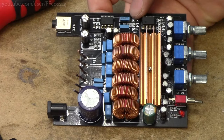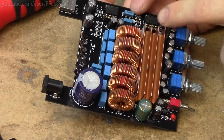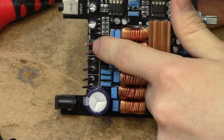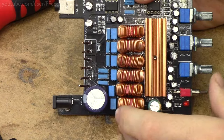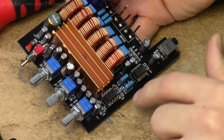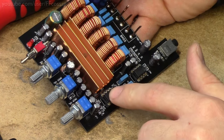So before we wrap this up, here's just a quick look at the actual board. Notable features, we've got two NE5532s there, obvious Chinese copies of some brand name. The board was originally delivered with just the holes there. I soldered some pieces of copper wire in there to probe around. Most of the filtering components seem to be centered around the op-amps there. So if you wanted to, you could probably just reverse engineer this and change the filter around quite easily.